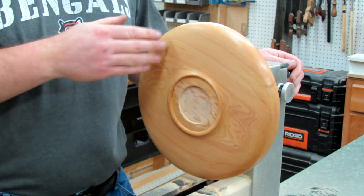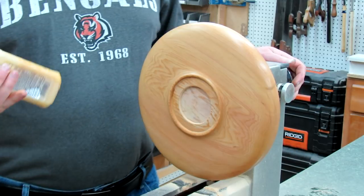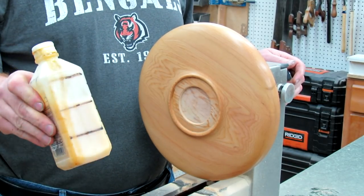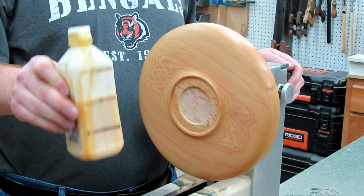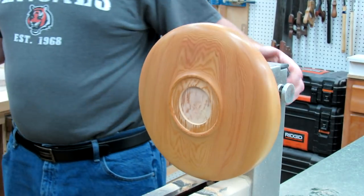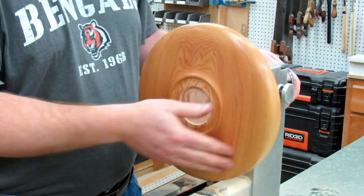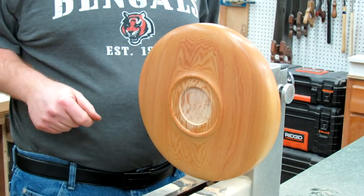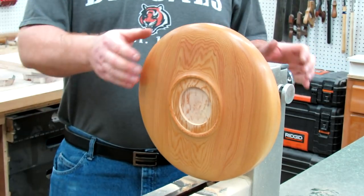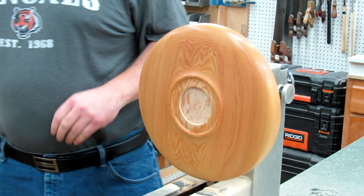This is just my own little mixture that I've seen a lot of people use — three equal parts of boiled linseed oil, shellac, and denatured alcohol. You just shake it up each time, apply it to the wood, let it dry, and it's protected. Just keep building up coats as you go. For now I'm just going to do the one coat to seal the back end.